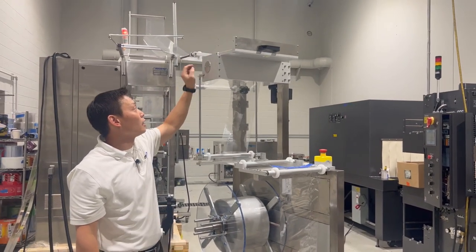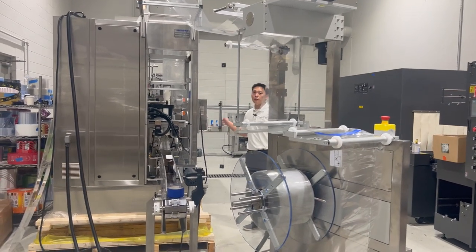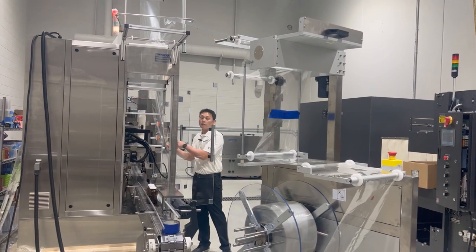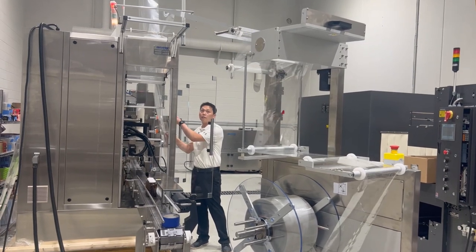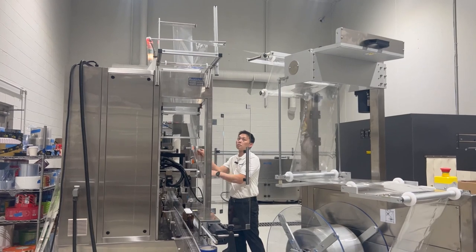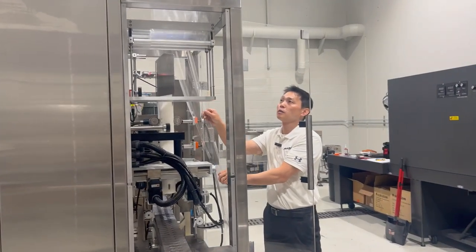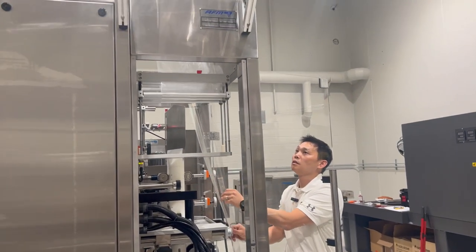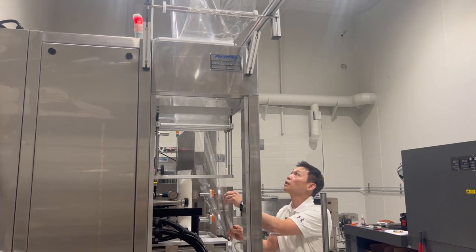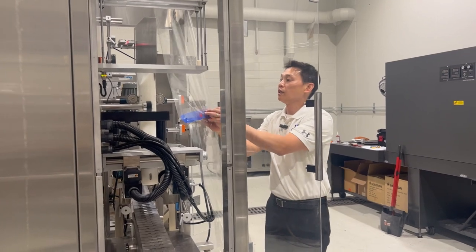What I'm going to do is take this and follow it through the film path. I'll lift up the dancer bar cover here so that'll relieve any pressure on the film. I'll go over to the machine side and pull the film all the way through until it comes across. As you can see, the film splice is going through the film path in the dancer bar and up to the top of the machine. As I pull this, I'm watching that splice come down to where I can grab it and pull it. Now I have my new film ready and waiting to put on the mandrel.